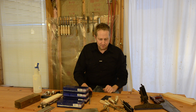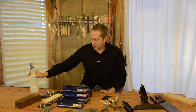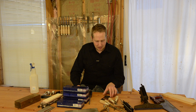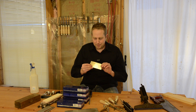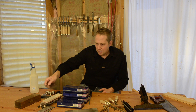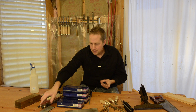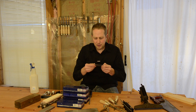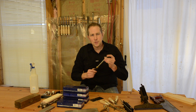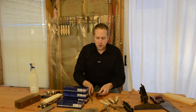I'll share links on my website. Also, a good water bottle for spraying down your water stones after you've soaked them. Now let's talk about card scrapers or cabinet scrapers. You can use your lapping plate, or these diamond stones, to flatten and give you a square edge. Then you'll probably need one of these burnishers — you shouldn't use a screwdriver. A burnishing rod is what puts an edge on it. You can check out a tutorial I have on that.